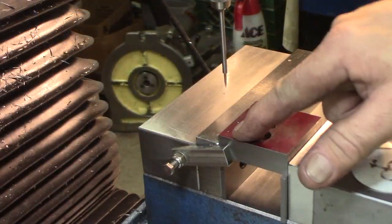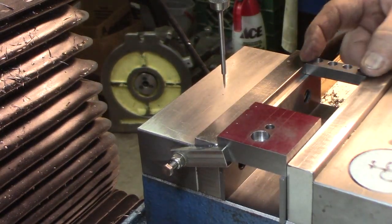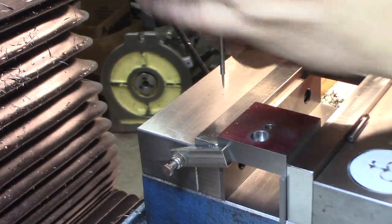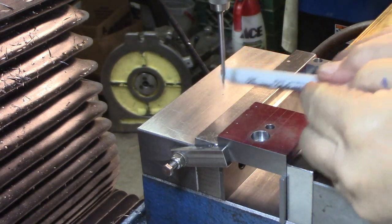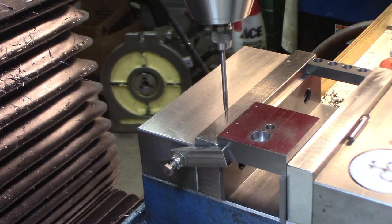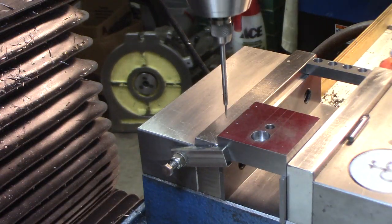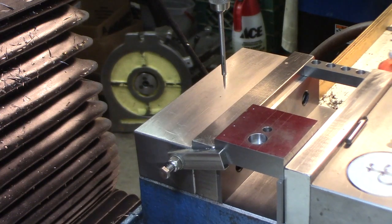Now you got the block in there. Here's those center punch tools, here's my little block I used — that's the dovetail block. You put it in here as a spacer so it's the same as two inches as the block. I used a wiggler. Get our wiggler, put that around now, and then just come up here and gently push on it until it spins through. That's lined up, and I'm going to save that point in the DRO, and I'm going to ride out here to the next one.